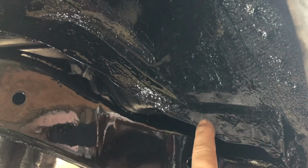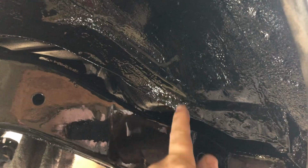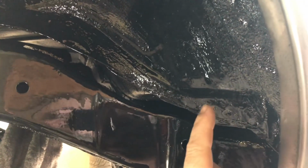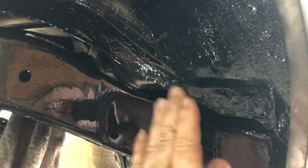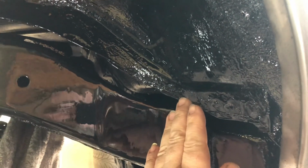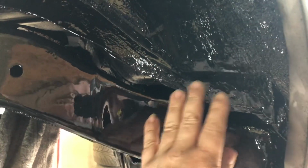This car right here, I was able to roll the tub in because the car is solid. I just kept tapping it with the hammer, tap, tap, tap, tap, tap. Forearm workout. But anyways, you keep hitting it nice and smooth, flat, and it heats up the metal and it rolls it. Some spots where there's a seam is gonna get tougher. But this car is solid, so that's why I was able to do this real nice.